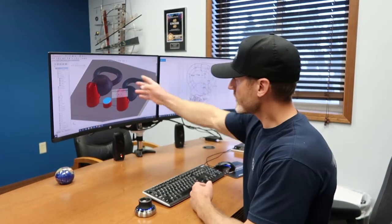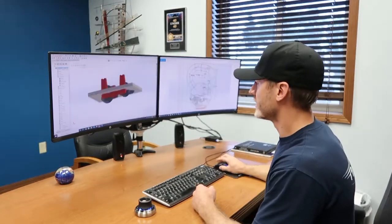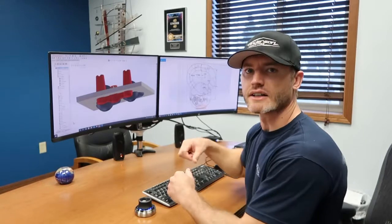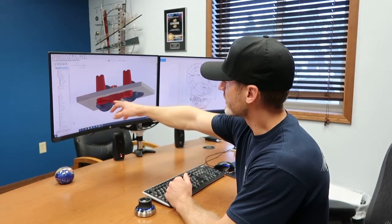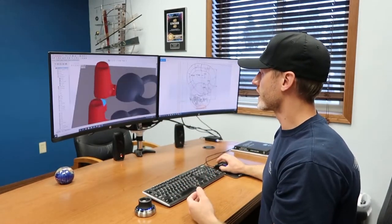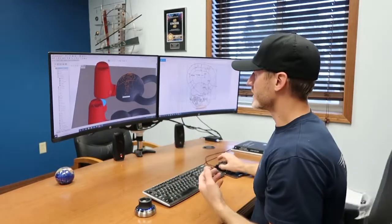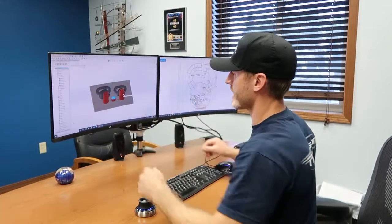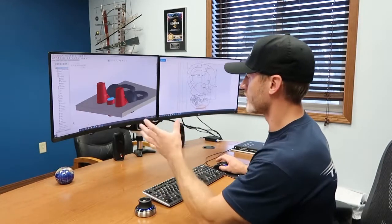There's a little filter block where we filter all the slag out of the iron, so we get only good quality pure iron into that sand mold. The iron flows down through this filter block into the bottom well, which we're using as a runner bar. The iron runs over to the side and fills these two risers, which feed directly into the sand mold for the casting. This pattern makes a big block of sand with a cavity left by an impression from the tooling — everything you see here that's red and black is going to be iron.